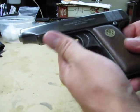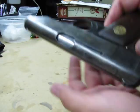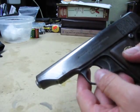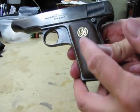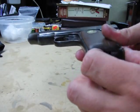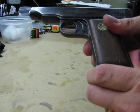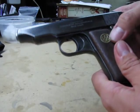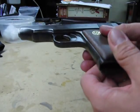I had this completely stripped down to armorer's level, re-blued it and refinished it. As old as the gun was, it didn't turn out real bad — it was a cold blue by Birchwood Casey, I put three coats top and bottom on it. For the grips, there's another video on YouTube that shows it better, but inside the magazine well halfway down on the back strap there's a little bar you have to depress with a flat screwdriver or an Allen wrench, and that's how you pop the grips off. Otherwise these very fragile grips will break and you'll end up having to repair them.